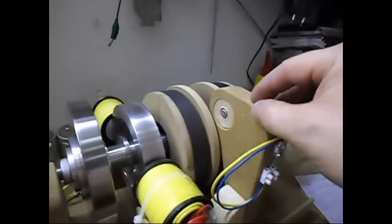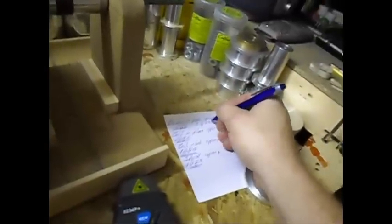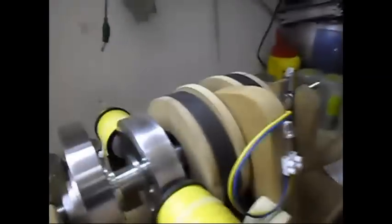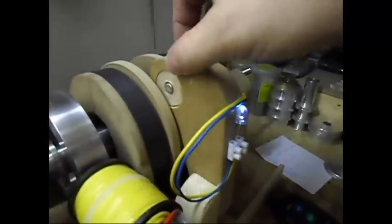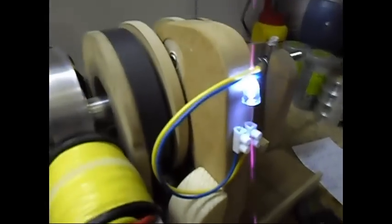1925 RPM. Now I am going to put the coil in its place. In my setup I made a mistake — if I put the coil directly between the discs, I have absolutely no output. Nothing, absolutely nothing. For me to get output from the coil, I need to put it on the edge of the disc. Here I have less output, less again, and then the best output is just around here. Any more and it will burn the LED.